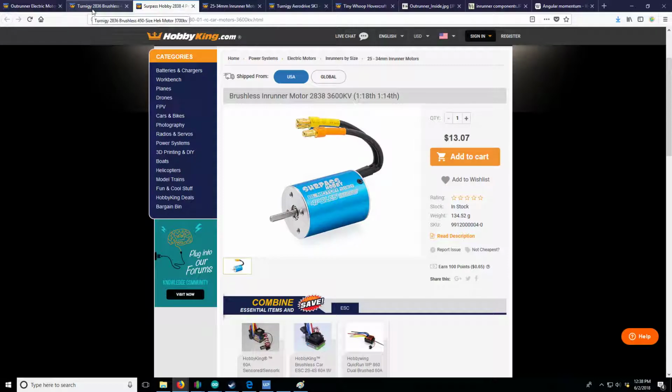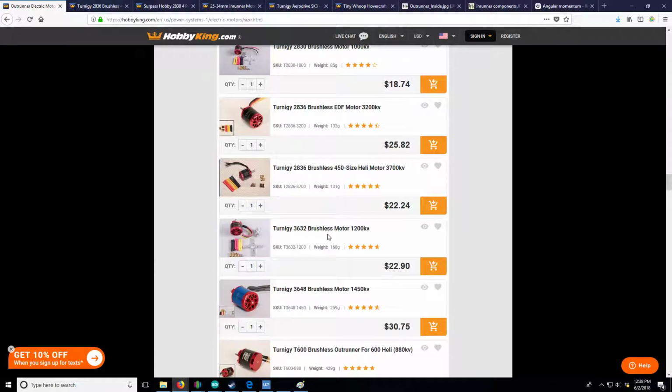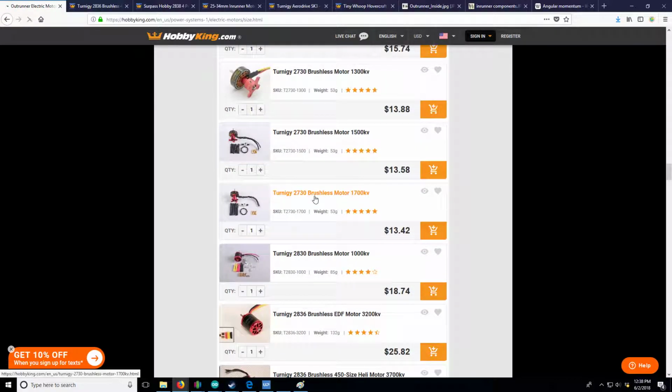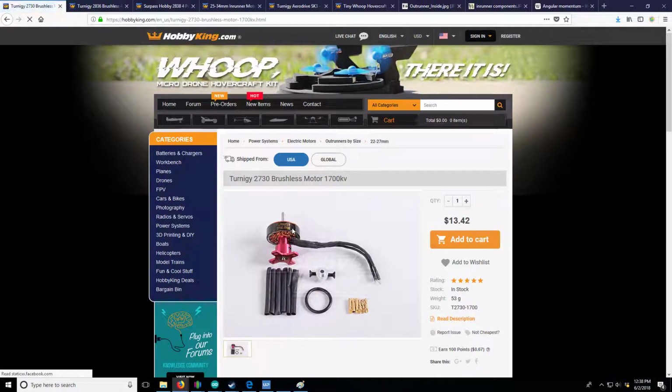While on an Outrunner, generally, I guess you could say it like this. Generally, this guy's stationary, but this whole thing rotates. The bell rotates with the shaft, right? So the whole thing's rotating. There's nothing really for you to bolt on unless you bolt on down here and you come up and you come over and then you attach. And then you have a spur to spur gear. Because this guy is rotating at the same speed that your prop or your gearbox or whatever's rotating. So in this case I'm talking about a prop. So that's difficult to work with.